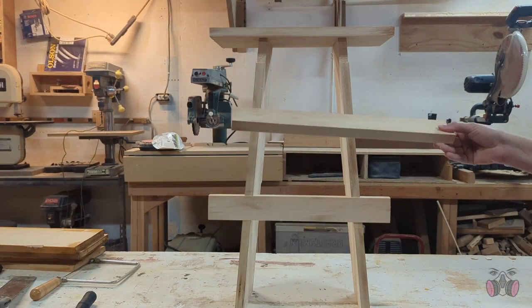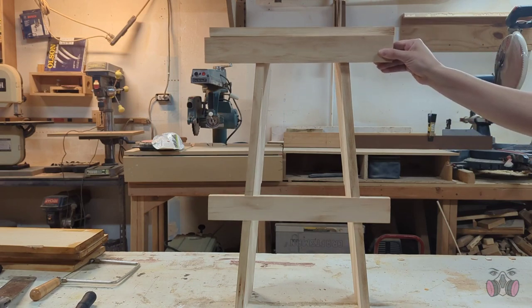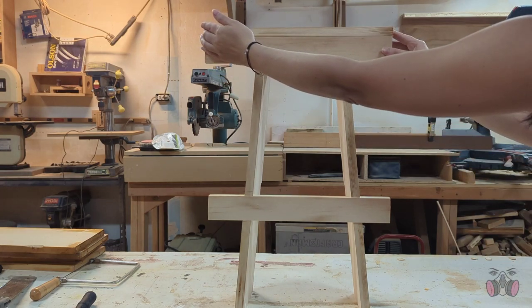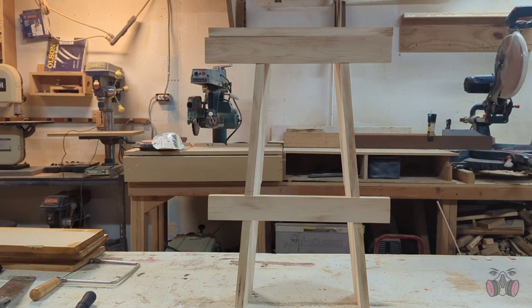This is how everything is supposed to fit. These wooden strips were made out of the remaining shelves that I'm not using for the seats, which is why the blade was raised to equal the thickness of the wood. So now when I insert this strip, it is flush with the legs. Everything seems to fit how it's supposed to, so now I can trim down the supports.